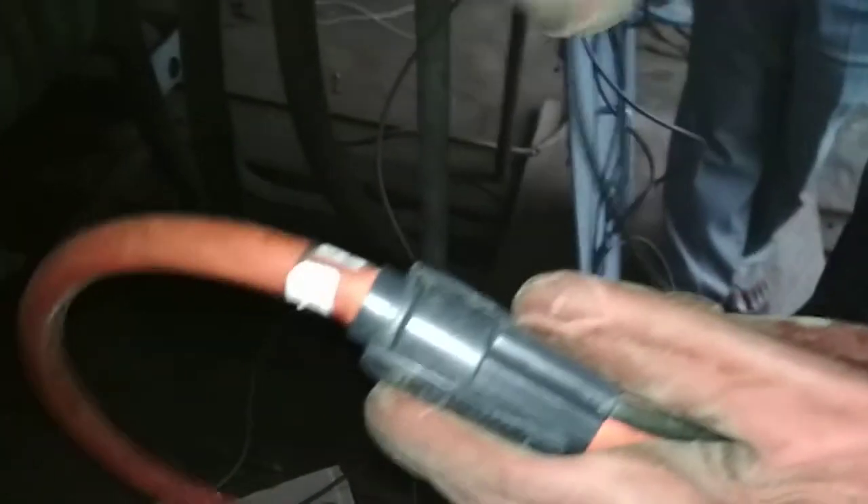Let me show you. This arrow indicates the direction of the current. You have to maintain the direction to get accurate results on your parameters. This CT is capable of holding up to 3000 Ampere of current.